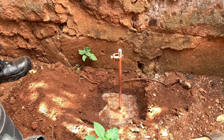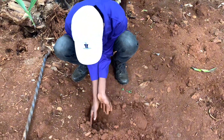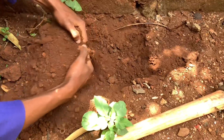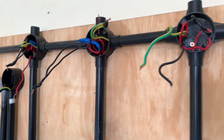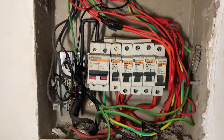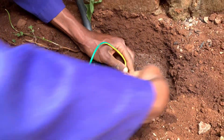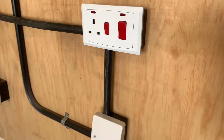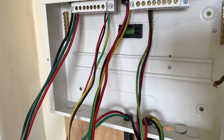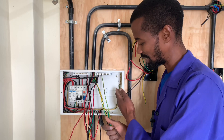We have talked about the earthrod and the earthing connection, but it is important to always consider the earth connections in the circuits in our houses or the electrical installation, because if that connection is compromised, then even if the earthrod is perfect in a perfect ground, it will not work in that installation. The earth connections we will connect to the earth bars that are here.